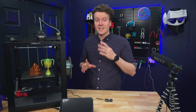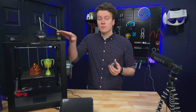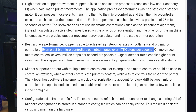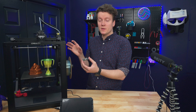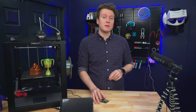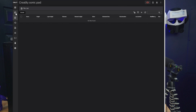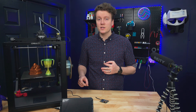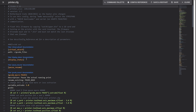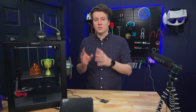The third big performance feature is just that it can go a lot faster. You have this separate computer that does all the mathematical computations, and the microcontroller just moves hardware — so you can send a lot more commands much faster. Beyond performance, there are a lot of ease-of-use benefits too. Since this computer is connected to the internet, you have a whole web page where you can control things, upload files directly instead of using a micro SD card, get better monitoring, and change the configuration of your printer — it's just a text file, so you change it, hit restart, and it reboots with the new config.